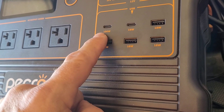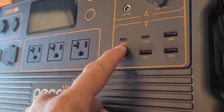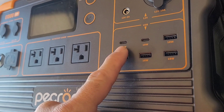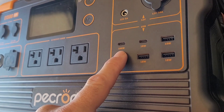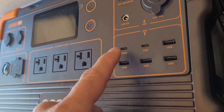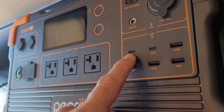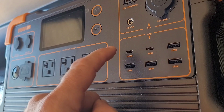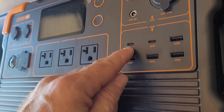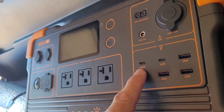The maximum current USB-C can flow is 5 amps, so at 20V × 5A you get 100 watts. But it always defaults to 5 volts so you don't burn out phones. In order to get it to go to a higher voltage, the device you're plugging in must have a smart chip that tells the port 'I want 12 volts' — they do a handshake and the port jumps to the new voltage, but always at 5 amps.